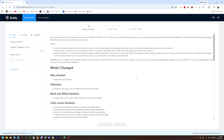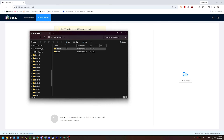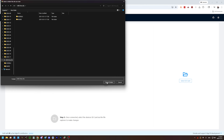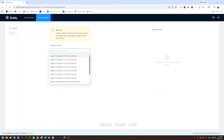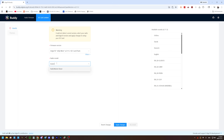Now we'll plug USB back in, go back to USB storage, and go to the SD card content section of EdgeTX Buddy. Here is my SD card: power on the device, select SD card — that's going to be USB drive K — select folder, allow the site access. Notice that EdgeTX can't detect the current version because we wiped out the SD card contents. We're just going to select the correct version 2.11.3 and select our radio model, which is the Boxer.